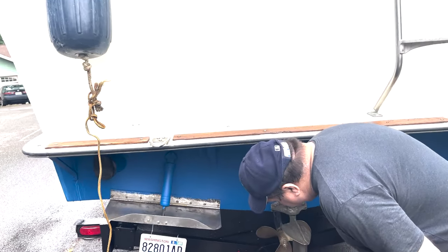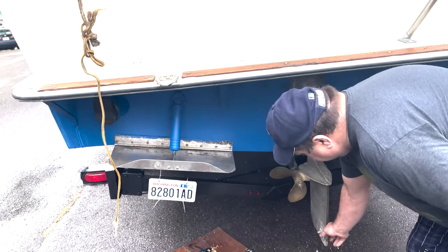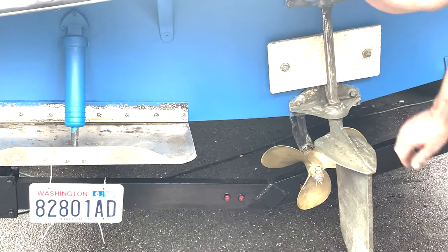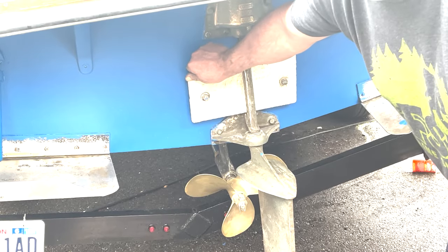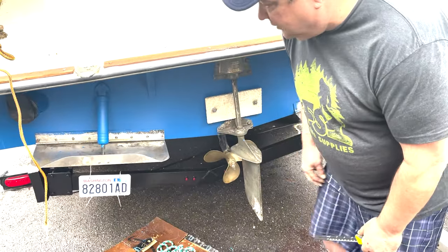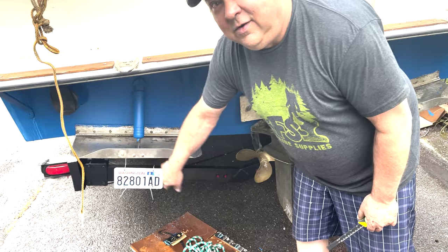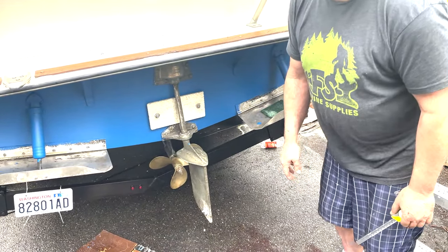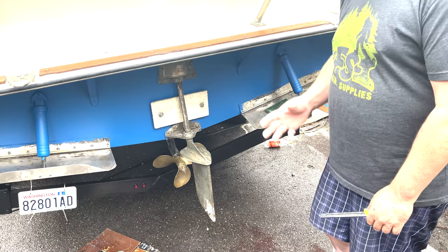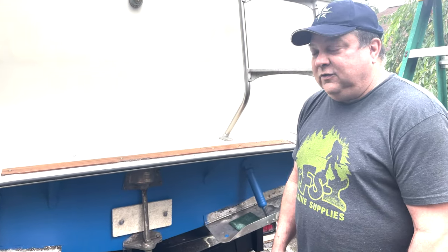there's really no bad stuff on the boat, but you can see around the rudder where it's starting to wear off. And the zinc plates, it's all starting to corrode and pit and wear away, and eventually it'll be gone. Like the zincs that used to be here have now eaten away. And if you can see the prop shaft zinc, we'll look at it later. It's almost completely gone.